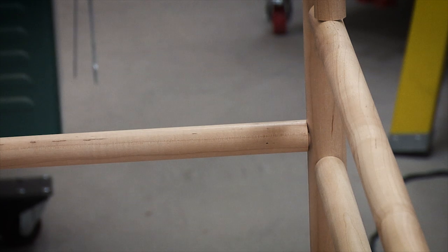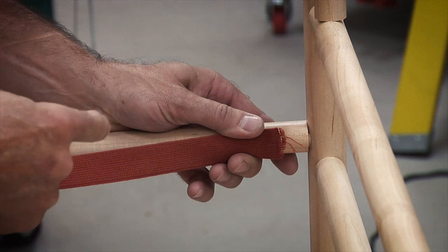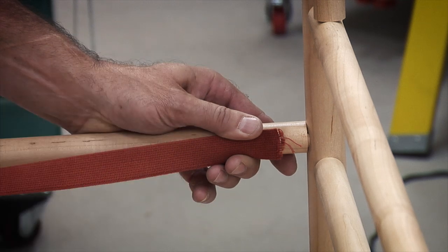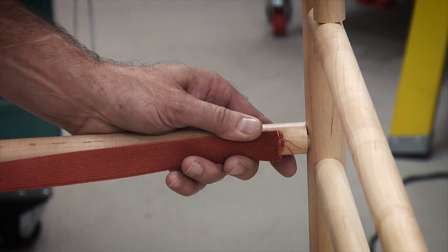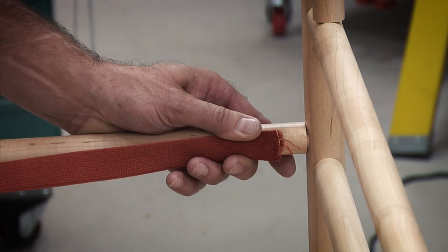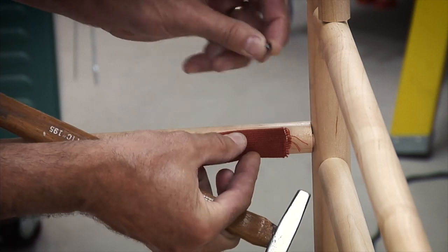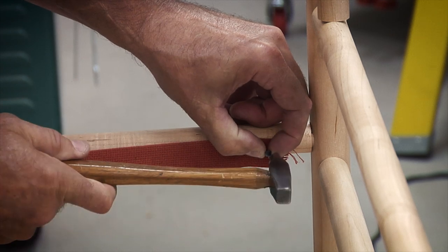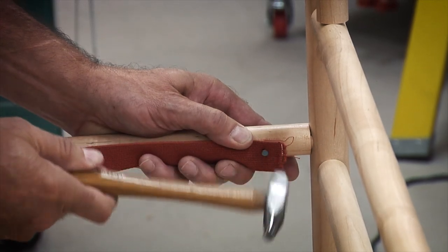The first step we're going to take here is we need to secure the tape to this side rung. We're going to do multiple passes moving from left to right here. This is called the warp — W-A-R-P. So we're going to do the warp first. I'm going to tack this on and just keep wrapping this around. I'm not going to make it too tight at first — we can always come back and snug it up. I'm using number four upholstery tacks.